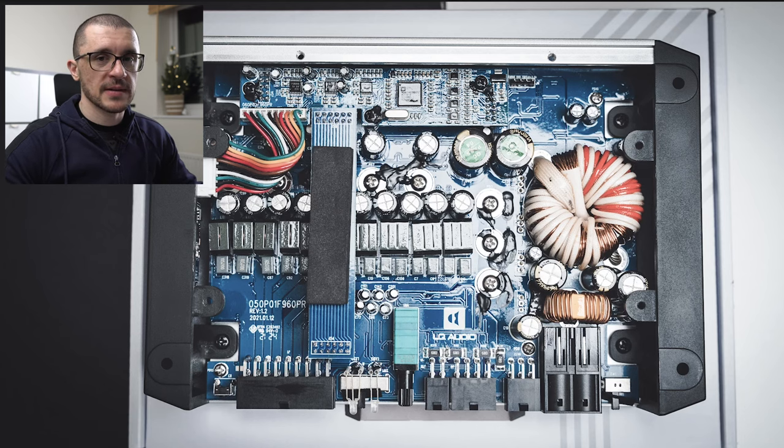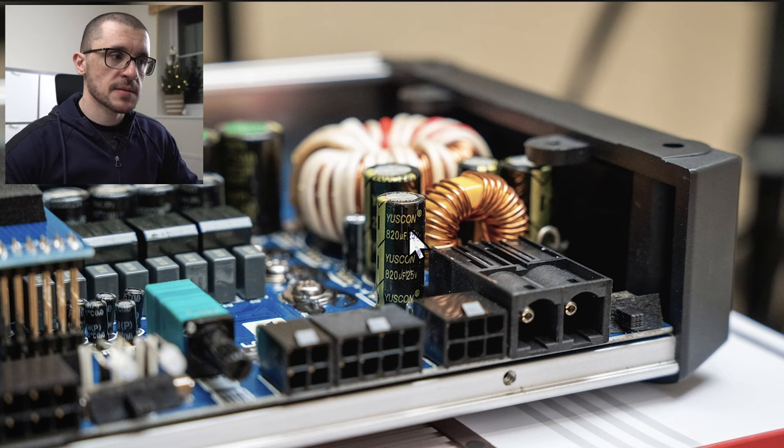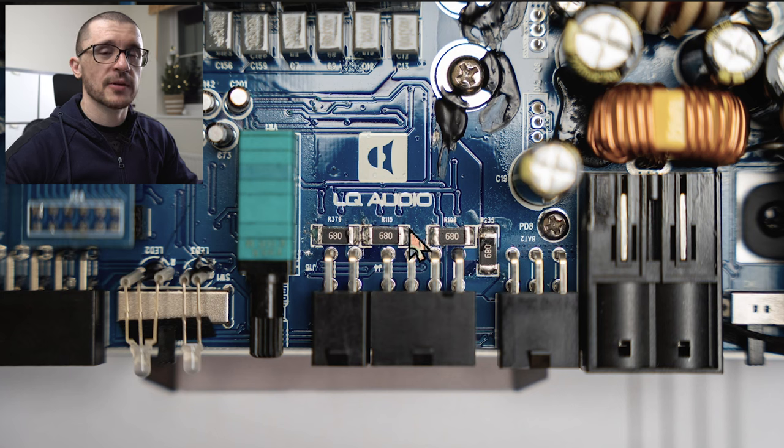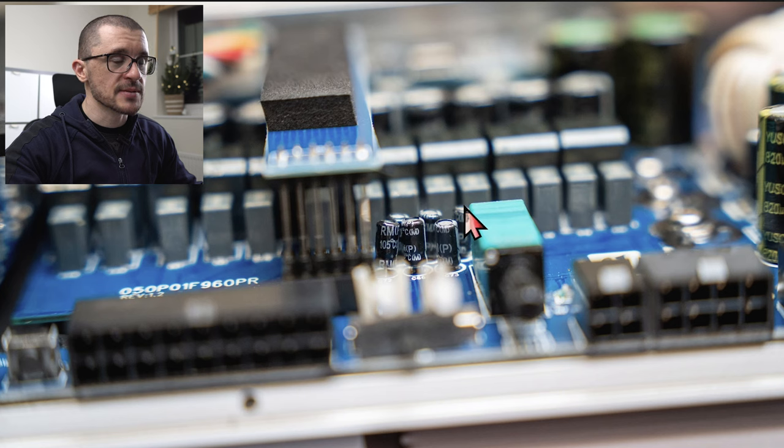Because I'm by no means an expert in electronics, I started to apply my engineering mindset — I'm an automotive engineer, a mechanically biased engineer. What I could find is that KNE is a manufacturer of PCBs, and these are some of their codes. This board has had a revision in 2021. The capacitors used are the same type and brand that I've seen on JL Audio, and this is where the resemblance with JL Audio stops — if you look at JL Audio's PCB boards, there are a few levels on top of this. Judging the build quality on the PCB board, we can see some areas where the soldering was done by hand. They're not the best looking soldering joints possible, and the components are not 100% straight — although in the electronic world this might have absolutely no reflection on the quality of the sound.